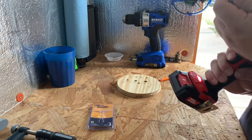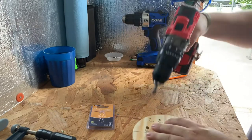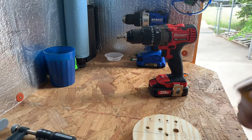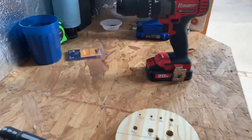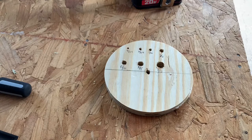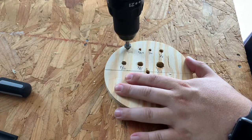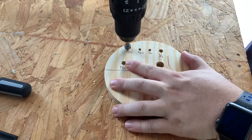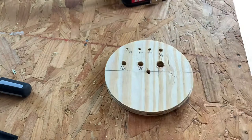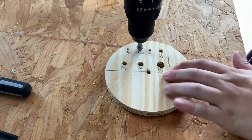We'll start it on this Bauer here. I'm just going to put it straight into the drill without any attachments. It says it's good for deburring and countersinking. We'll see if this works — going to be on the 9/64 hole, on number two, so full power drill mode, no clutch. Running it just a little bit... yeah, I could see where it would deburr a little bit, but it wouldn't really countersink. Let's see if we go into this one.